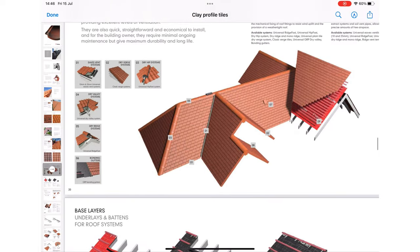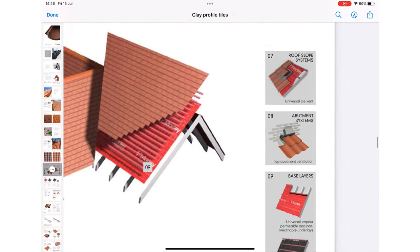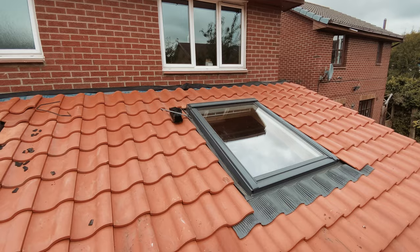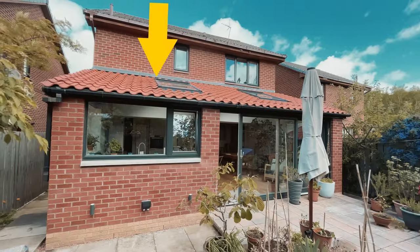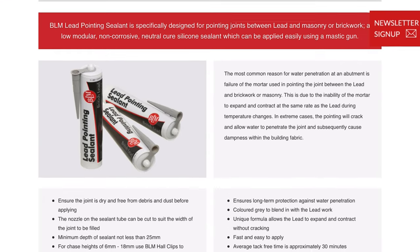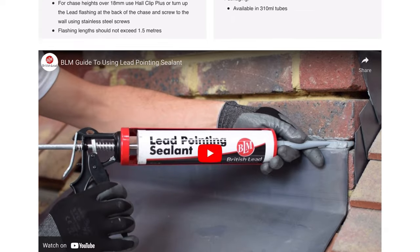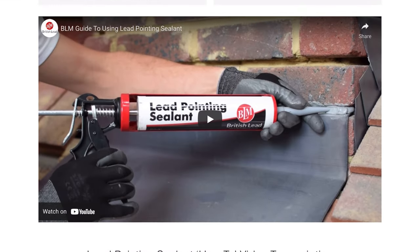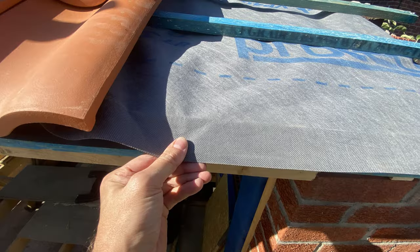Where the new roof meets the wall — the abutment detail — to keep the water out we usually use lead or zinc, and we call these junctions flashings. I'll need a minimum 150 millimetre upstand for a flashing detail, which will tuck into the horizontal course of the brick. You might want to consider getting a skilled tradesman for this if you're unsure, but otherwise you need a grinder, usually a 300 millimetre roll of code 4 lead — although I can't remember if I used 600 here — and a sealant gun with lead mastic and sealant to seal along the lead and the brick course. Don't rely on mortar, as the expanding nature of the lead will just crack it through the changing seasons and water will eventually get in.